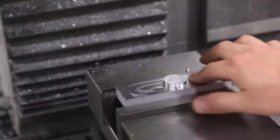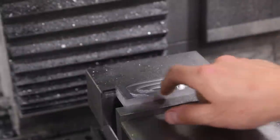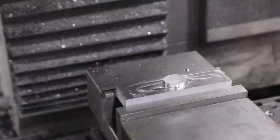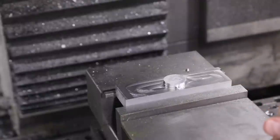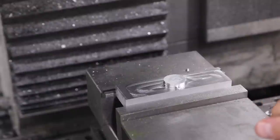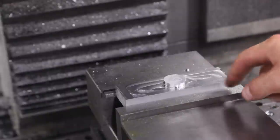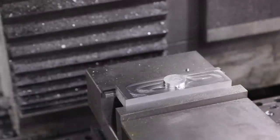Really pretty good surface finish. You'd want to clean it up with a finish end mill, especially on the side profiles. But getting the material out of there, that was 2.4 cubic inches a minute at about just under half a horsepower. Let's not mess around — let's just double it. 80 inches a minute, same 0.2 inch depth of cut, 0.3 inch width of cut. That'll be 4.8 cubic inches a minute and just under one horsepower of spindle power required. Let's see how she runs.